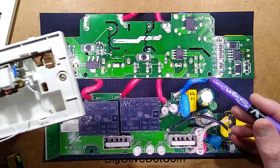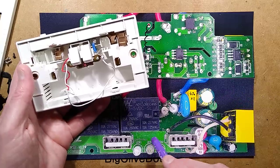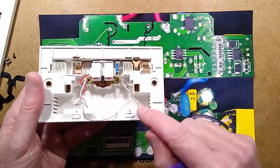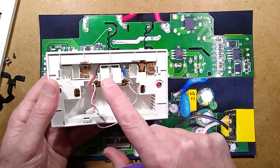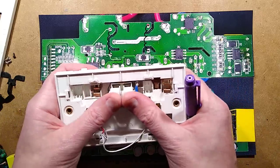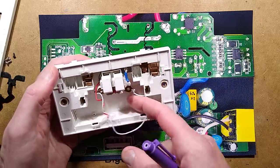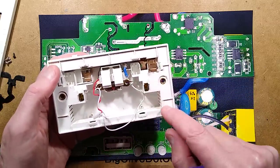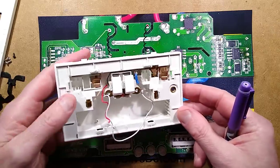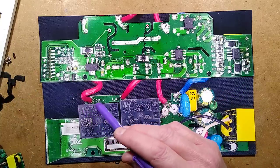The switches have contacts that are normally closed and open when clicked — presumably the way it worked originally. But the separation between the low voltage side and those contacts isn't great. Particularly this connector — if it had a bad connection, started melting and moving as they sometimes do, it's very close to the low voltage contacts. That's where the separation of the unit kind of gets ruined. It would've been nicer to use small tactile buttons or an auxiliary board with fly wires instead — but they've opted for this, probably for economy, repurposing an existing switch. They've adapted it with the ESP8285 receiver.